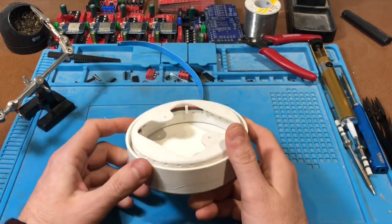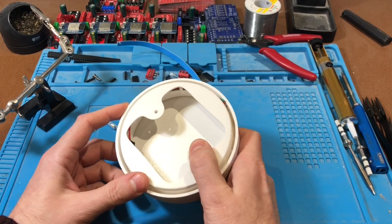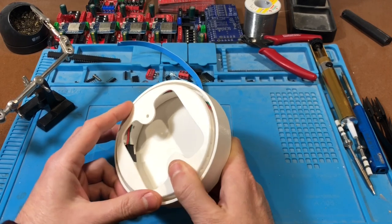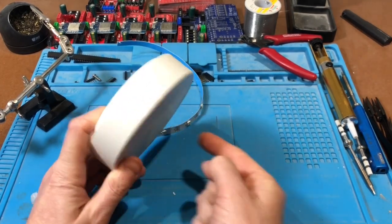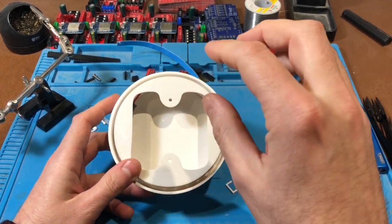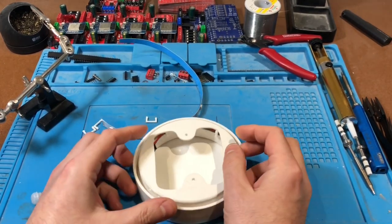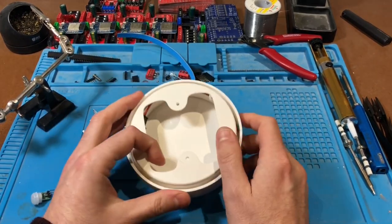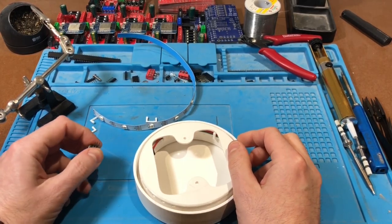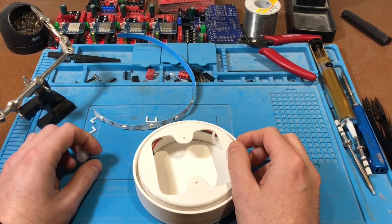I'll have them going into the ESP32 running Tasmota, and then signals being sent to Node-RED, and I'll use Node-RED to determine the rules and the timings of what happens. But I think that's quite a good way of working. So the PIR senses the initial movement, turns the lights on, and then the ambient noise extends the amount of time that the lights are on. And if for some reason they do go off, I'll have a separate double clap, which will trigger them to come back on again. Obviously, the light sensor will allow you to not have the lights too bright if it's already quite bright in there, or if it's really, really bright, there's no need to turn the lights on at all.